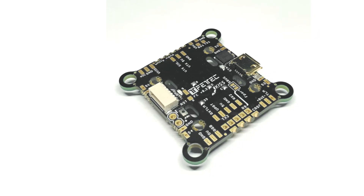What I would have liked to have seen from the team at FetTech is: sure, have the KISS tax, but provide the F7 processor on the all-in-one — which after all is on the 20x20 or 30x30 KISS FetTech FC. It would have been great to have delivered multiple UARTs on a board with usable solder pads. I'd also have been okay to forgo the traditional diamond mounting pattern if they delivered the all-in-one with a 20x20 mount, which would go straight onto any of the Impulse RC micro builds like the Apex, Reverb, or Micro Alien, and many other 3 and 4-inch micro quads as well.